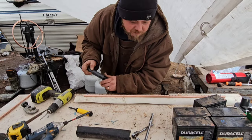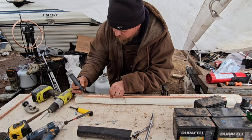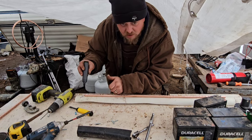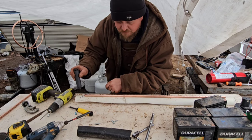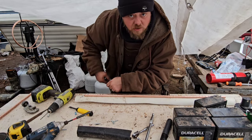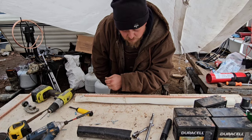While I'm remembering — I need to put a mark. I'm putting a check mark here and a check mark there. That's going to identify this side of this tube with this side of the pipe, in case I'm moving things around as I'm putting it together. I don't want to use the wrong templates because they won't line up exactly the same.